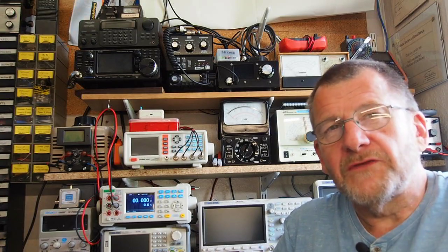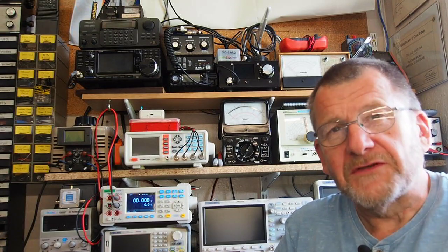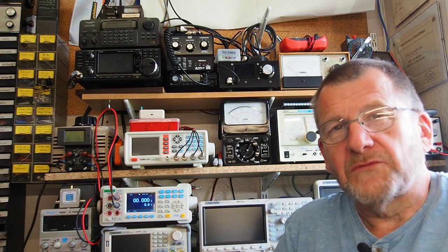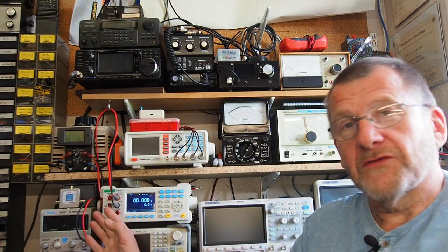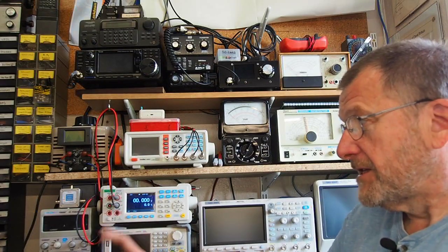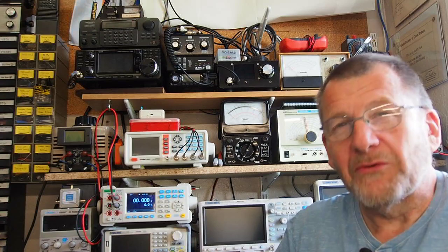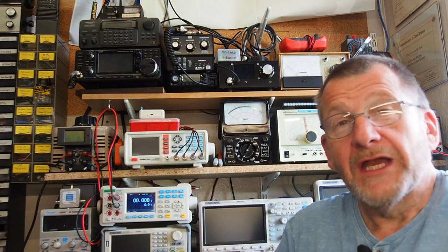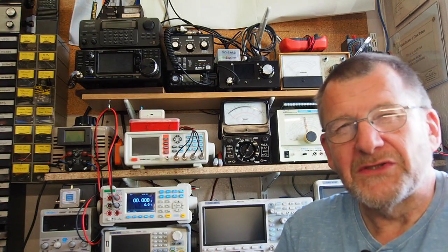I thought I'd complement the two videos already on YouTube about this meter. The first is from Steve at SDG Electronics — he reviews this meter and the next model up, and makes very reasonable comments. He's impressed with the accuracy, as am I. His main criticism of this model is the slightly weird 100 milliamp current setting, with the next being 10 amps. Steve said it'll catch you out — he's absolutely right, it caught me out once and I had to replace the fuse. That's probably why they send you several fuses with the instrument. The trick is to use the 10 amp range initially, then switch to the 100 milliamp range if you need more accuracy.